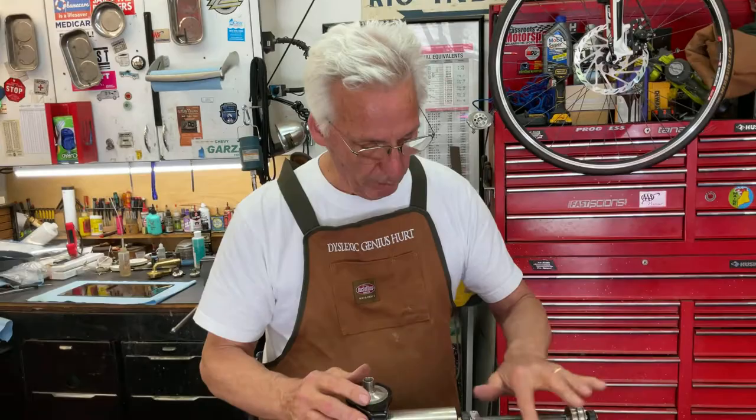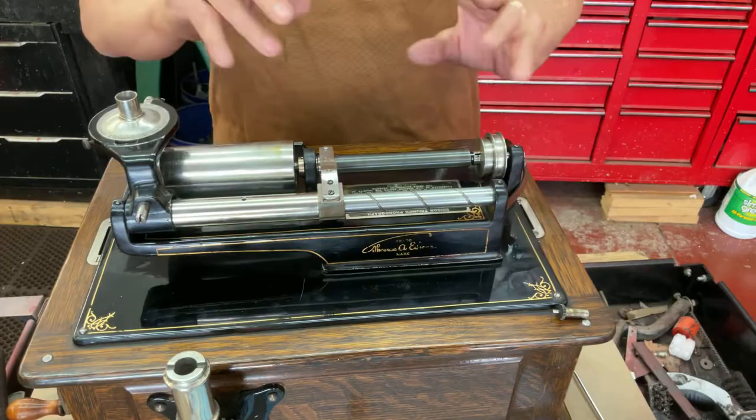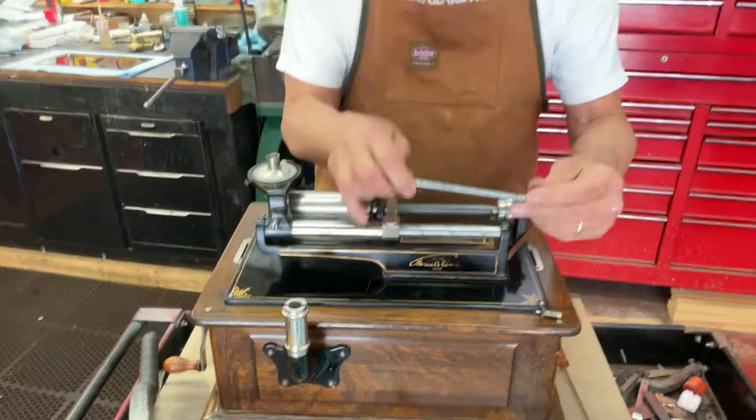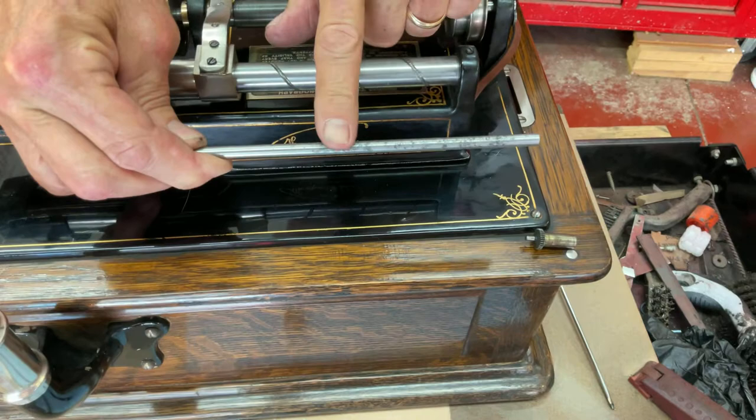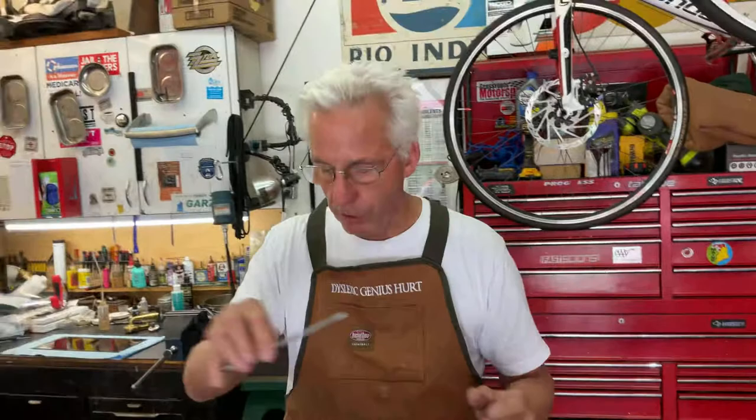The other thing you do is make sure your back rod — this piece here, all Edison machines have these — is clean and smooth. You want to sand these down. I've talked about cleaning these with a drill. You don't want to have a lead screw like this off an Amberola 30 that's rusted to death — you'll need to change it out. I change these out in stainless steel, because it'll never rust again and it has better running surfaces.